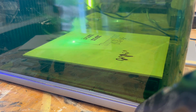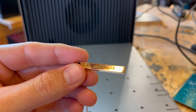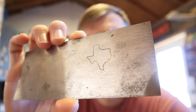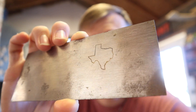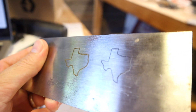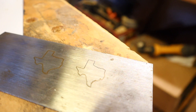Because both lasers have 20 watt power, the F1 Ultra can not only engrave and cut but also perform deep engraving on metals, 3D emboss on wood and metals, and even cut thin metal pieces. For comparison, I have an old engraving done with a 2 watt IR laser from the original X-Tool F1 — the fiber laser in this machine is 10 times more powerful. I did the exact same image on the exact same card with this laser and it took seven seconds to produce a deep engraving — not just a surface etch, but actually engraved into the metal.